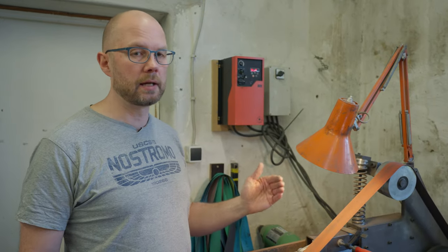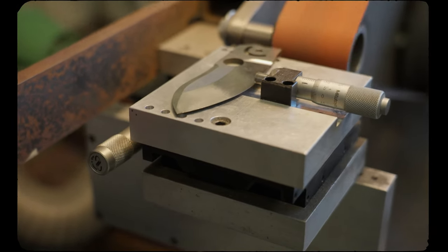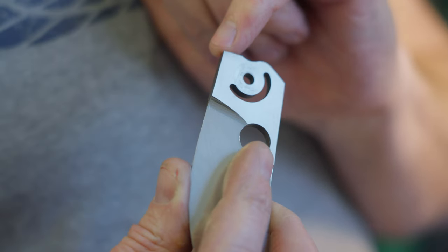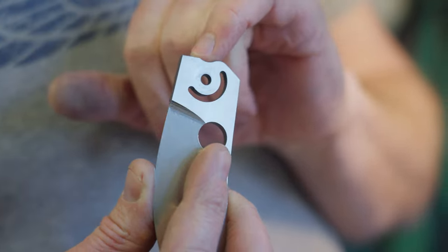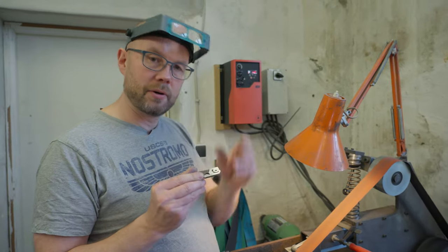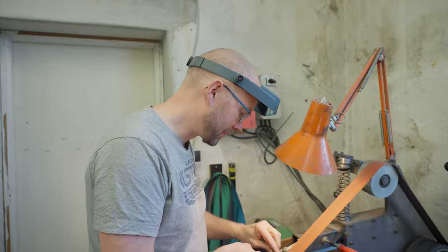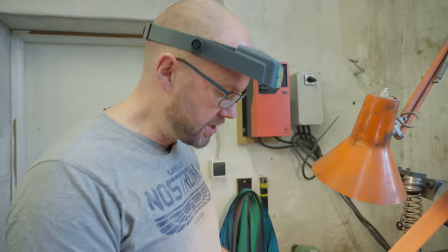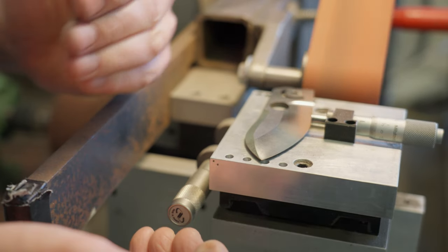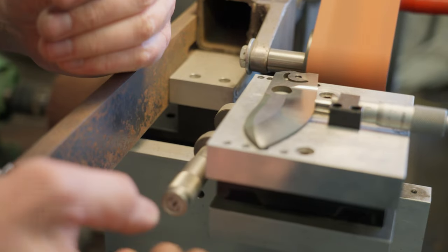Once that's established, I can redo all five knives in this batch and have them all within just a tiny amount of adjustment. Now I'm easing my way into the scribe line — ideally I want to see it touching the line and grinding half of the line away. I can somewhat see it with these on but you really need the good goggles. Now I'm actually grinding up against the stop so I don't even have to look. I can just move my way into the grind very slowly.